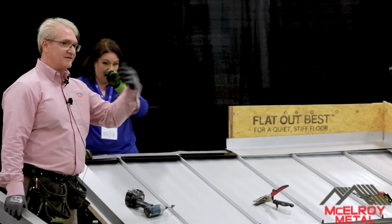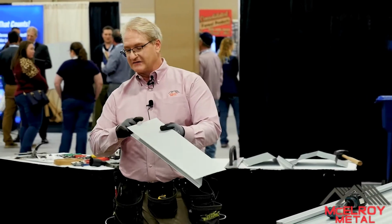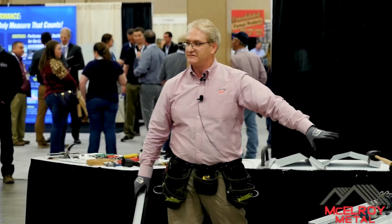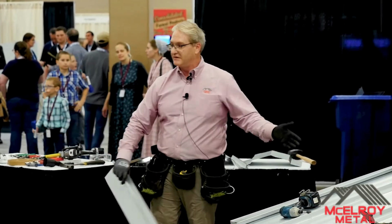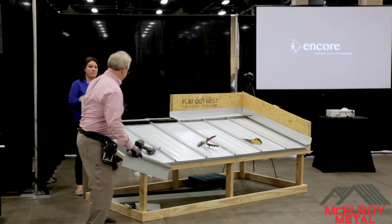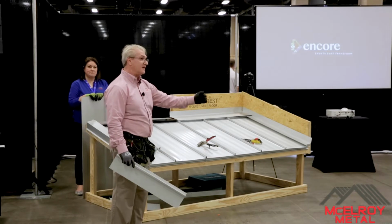So the whole thing is just like venting. You want to keep it about 2 inches off the top. Well, we came off a little longer here. And the reason being is you have to think about this. The panel, we hem 1.5 inches out of, and then another 1.5 inches. So technically it takes 3 inches out of the length of this panel. So if I'm measuring this roof, and this goes from the fascia piece all the way up to the middle of the ridge, and it says 10 foot, I add 1 inch in. So I call it 10-foot 1. Now what happens is I'm set 2 inches down from the center and I'm venting perfectly. That's exactly what I want, okay? So you gotta plan ahead on some of those things.